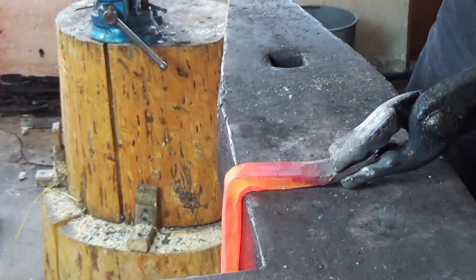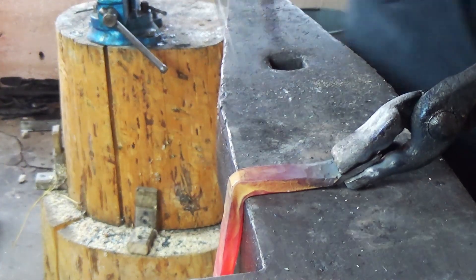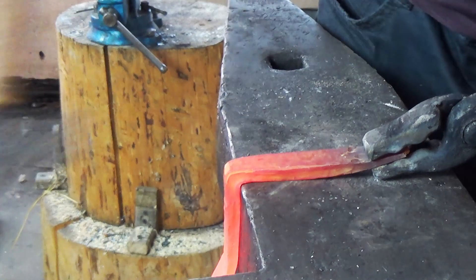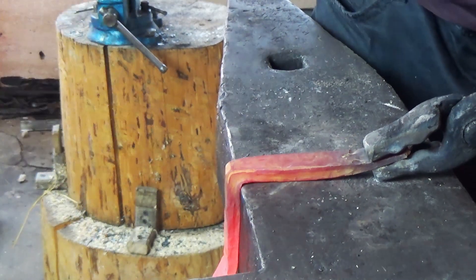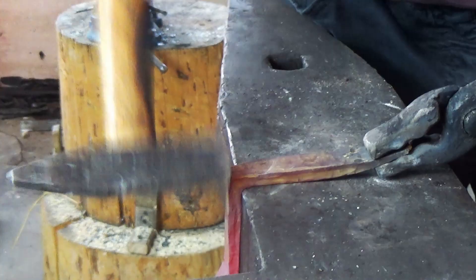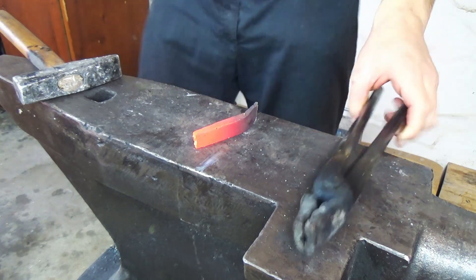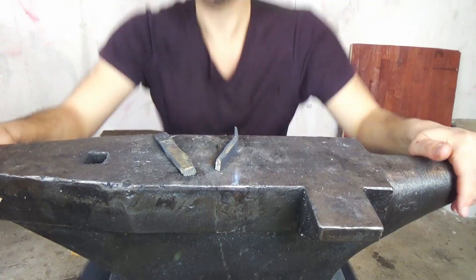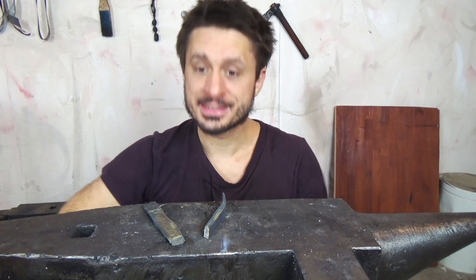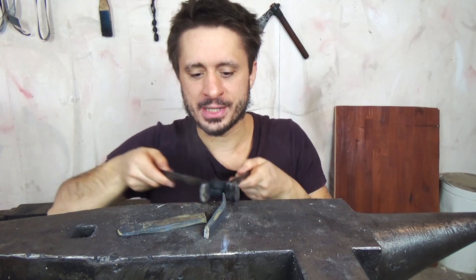I'm a little close up and I took a smaller hammer. I don't know if this was a good idea but I had the feeling I need to be more careful. I could judge better now what color it needs to be before I pull it out before it starts melting, so I don't lose even more material. But you can see the corner slowly starts to form. And then this happens — I didn't even hammer on it and this happens. So I think that's it. It broke in the middle and it has a lot of cracks in the ends.